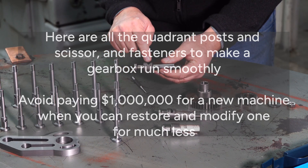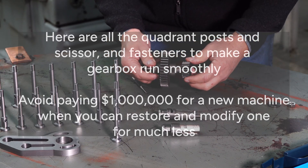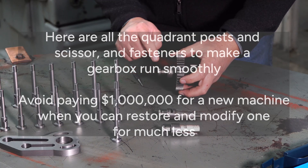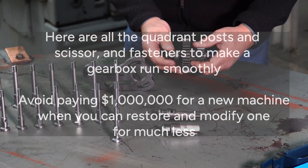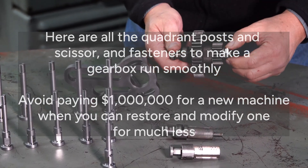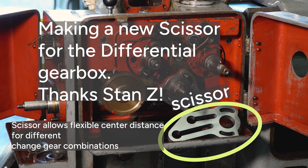Now it's always good to check that it's prime. Small prime two-number tooth gears are probably in your change gear set, but the larger the prime number, the larger the diameter of the gear is going to be and the less likely it's going to fit in your gear cabinet on your machine. It's a double-edged sword with gear design, because you like having prime number gears since they distribute wear in your gearbox evenly amongst the two gears running together — it's a common design attribute good gear designers use — but it's difficult to fit large prime gears in your gearbox sometimes. So that physical cabinet becomes a limit to some of the machines you might use.